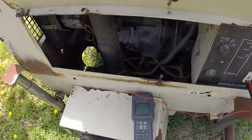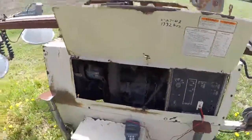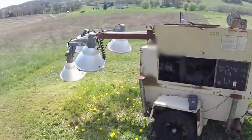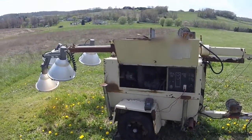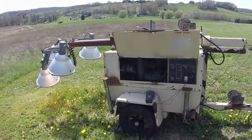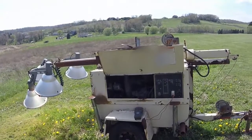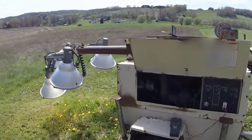Notice we're at 59.5 Hertz and 114 volts. Again, this is a capacitor-regulated generator, which you'll see how that kind of drops down. But 115 volts is, by all means, in an acceptable range, so I have no problems with it.